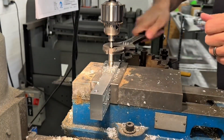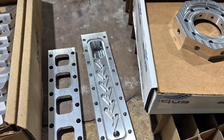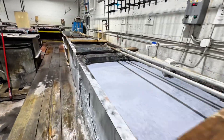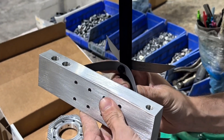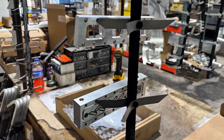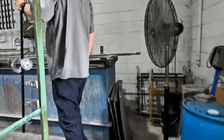The only thing left to do is hard-anodize these parts. Here we are at the anodizer — the company is called Anodizing Specialists in Mentor, Ohio. They were nice enough to show me through the factory and let me see all the different tanks. We have to dip these aluminum parts in to get them anodized. There's a wash rinse, there's acid obviously, and then there's colors — but for our parts we're not using colors, it's just a clear anodizing. First you put them on these little titanium holders and make sure they're not going to fall off.